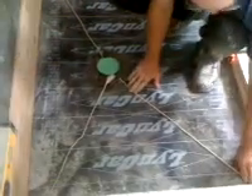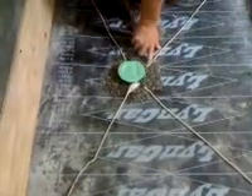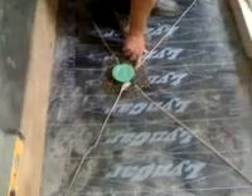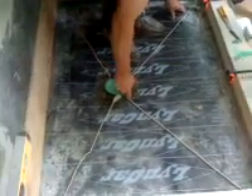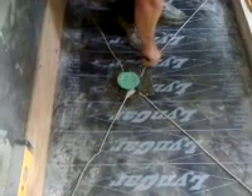To the drain, Ron is running cotton rope at an angle from the four corners into a pea gravel center, and there are small little slots at the bottom of that drain. So if any water should happen to get past the tiles, past the sealer and through the concrete, it will have a way to dry out and seep down to that drain, and there will always be the ability for water to move around it.